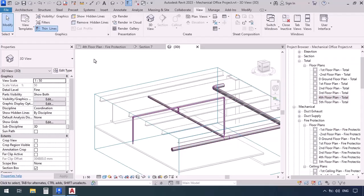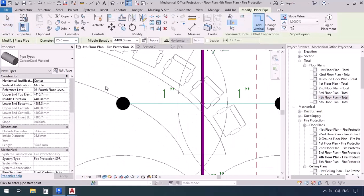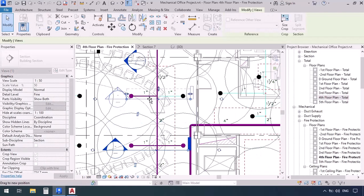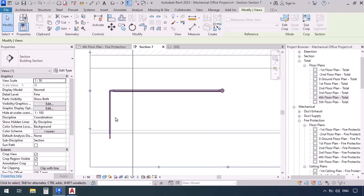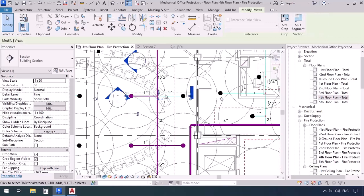We took a look at the NFPA and it said if we have dry lines and dry pendants like we have here, we could have a junction from the side as well. Let's go see how we can get a junction from the side. First I'm going to get the pipe command, then check carbon steel welded, then sprinkler diameter of 25, and the elevation should be the same as the main pipe, which was 3900. I'll click here, then click again, then press escape. Now I'm going to take this section and put it over here. Let's take a look in section — as you can see, the junction has been created from the side, so there was no need for a return bend.